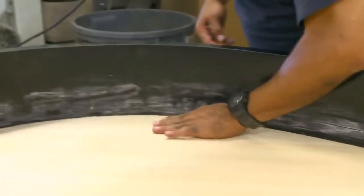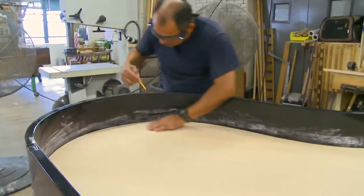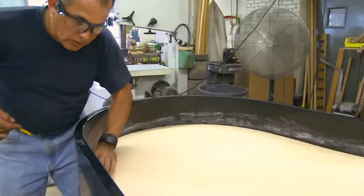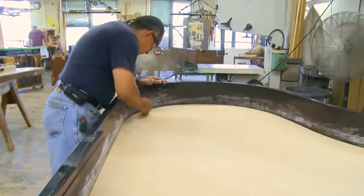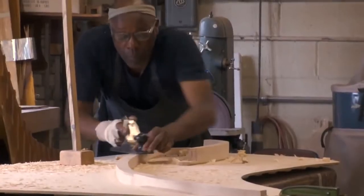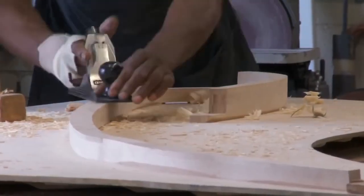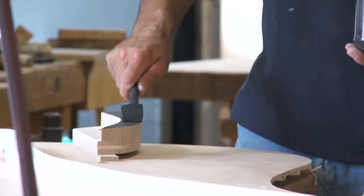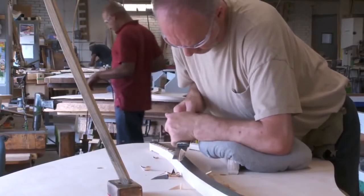To the native properties of the wood, we add an exclusive and distinctive feature, our famous diaphragmatic taper. It is fitted into the piano slightly crowned. This allows vibrations to travel freely along the grain to the center, moving more air, increasing the sound, and projecting it. The bridge, glued to the top of the soundboard, is made of vertical laminated maple, just like the grand rim. The bridge transmits vibrational energy from the strings to the soundboard.